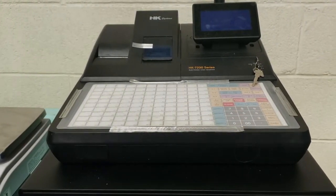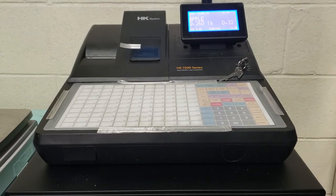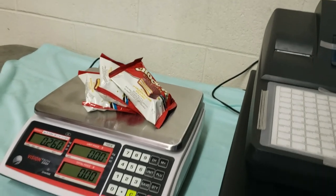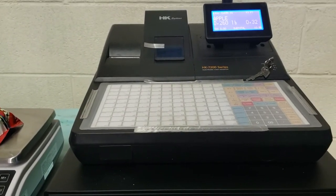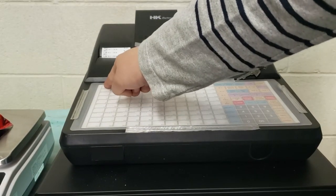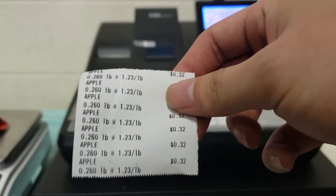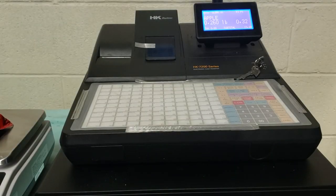Now that I've changed my TDP settings, I can go to my ECR and turn it on. When I place my merchandise on the TDP scale, you'll see that it reads 0.26. Going back to the ECR, I'll press my PLU number and you'll see it will print out the PLU price that I set before on my cash register — 0.260. The two devices are now connected. Thanks for watching.